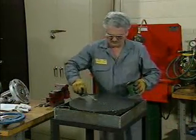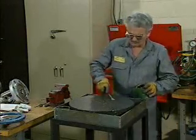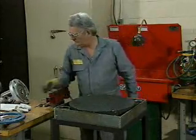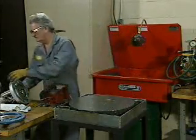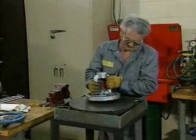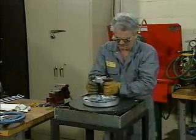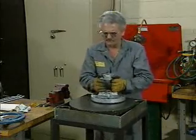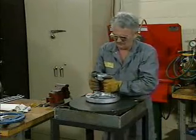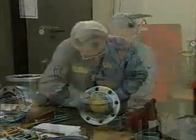To begin, he applies a small amount of lapping compound to a lapping block. To achieve a smooth surface, he starts with the coarse grade compound and gradually changes to finer grades as the surface is smoothed. The mechanic moves the bonnet through the lapping compound in a figure-8 motion, being careful not to exert excessive or uneven pressure on the bonnet. The weight of the bonnet should provide adequate pressure to smooth the surface.